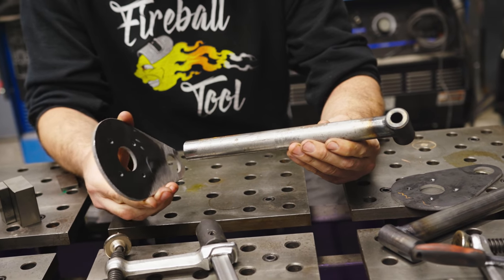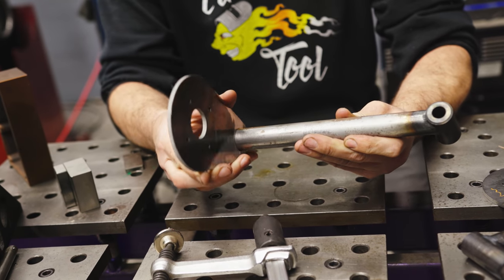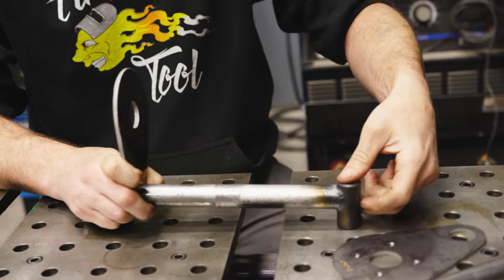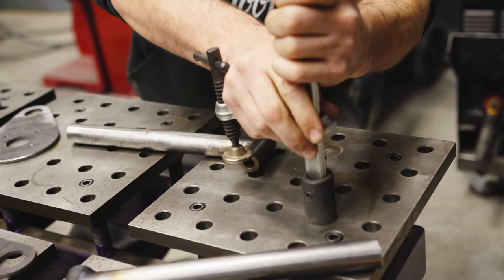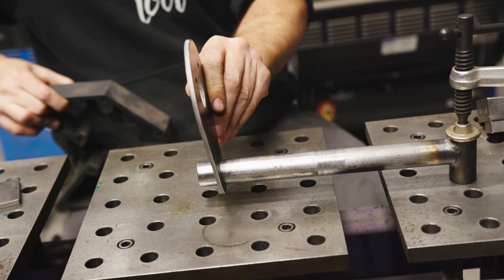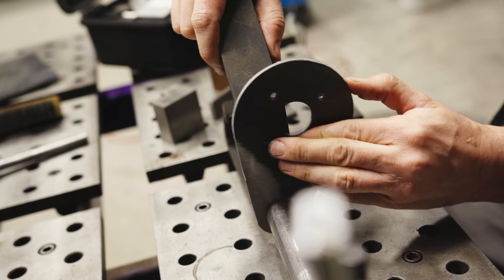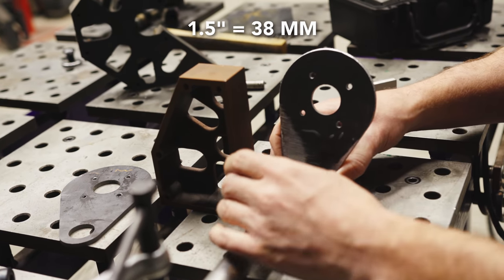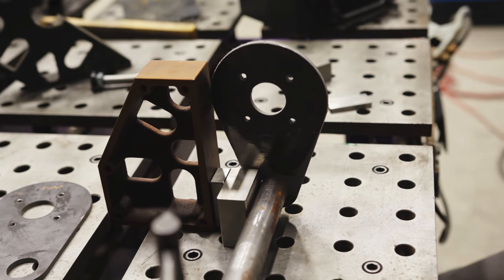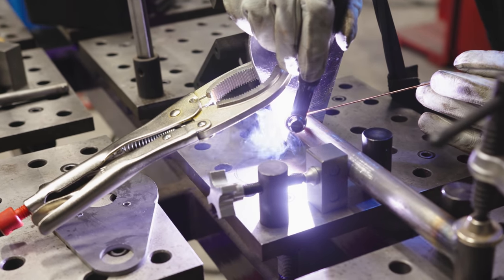We've got to get this tube attached to this little lily pad here, but I have some fabricating issues. I want this pad to be perfectly centered down this tube and perfectly lined up with this boss. Getting it plumb forward and back is pretty easy because I can use the mega square to do that. But getting the roll of the lily pad is trickier. All I need is an inch and a half shim plus some sort of stop — I'll use the minion square here, and when I bump it into that surface it is perfectly centered. Spending the little extra time to make yourself a welding fixture comes in handy when you're doing more than one.